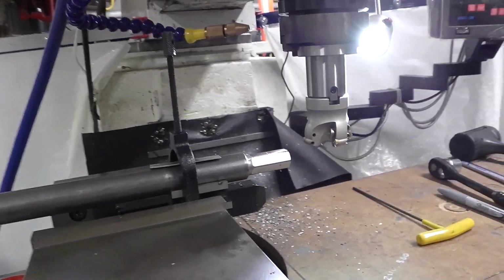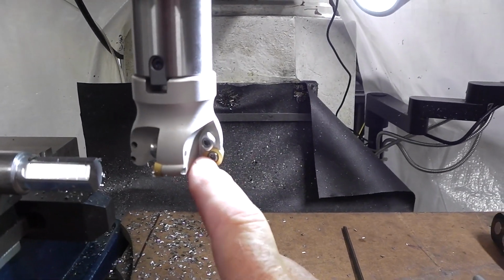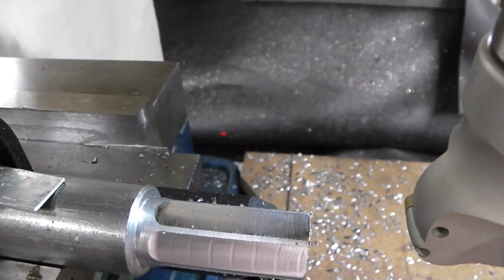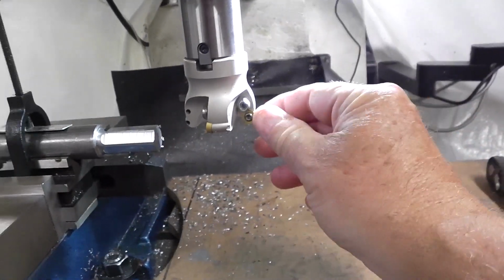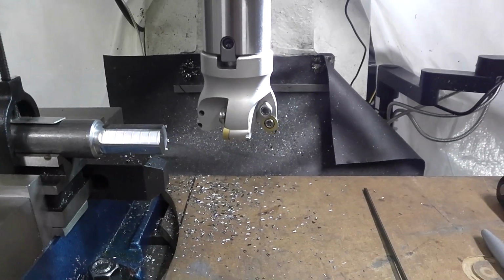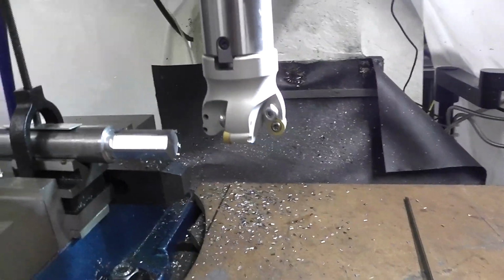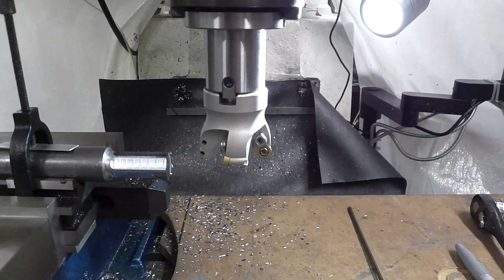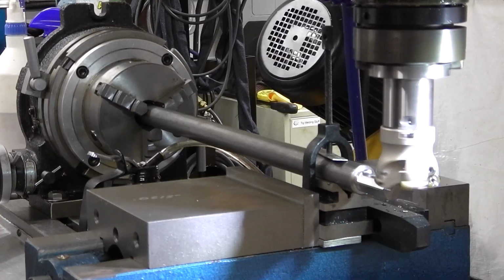And I got this new cutting head here. It has the round inserts and does a really nice job cleaning up. So I'm gonna use that. Maybe get one a little bit bigger. This works great on steel. The square ones work great on aluminum. So I'm gonna stick with this type of head for doing surface milling on steel. All right, guys, you hang in there. I'll bring you back when we're getting close to size.